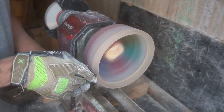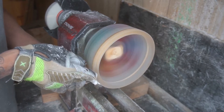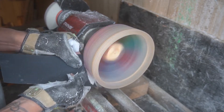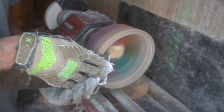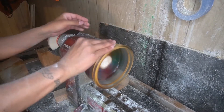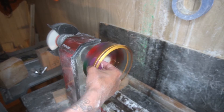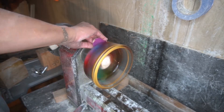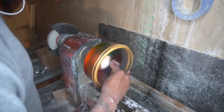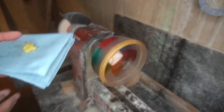Once we got everything cleaned up on the workbench, I'm just coming back hitting it with a 340 grit, and then we're going to hit it all the way up to the 1500 and then come back and hit it with a micro mesh like we typically will do with these bowls. Did a lot of wet sanding, which really makes the epoxy pop. I'm going to come back and do a different project using this similar technique but I'm going to put a lot more color into it.